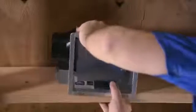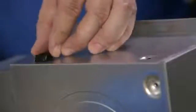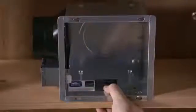Next, mount the fan housing to the joist. You'll notice that there are indents near the top of the housing. These are provided to accommodate the spacers provided with the fan. As the fan's housing is tapered, these spacers ensure a level installation when attached to the joist. Position the fan against the joist and use the screws provided to secure the housing to the joist through the spacers. Then secure the fan to the joist at the flange.